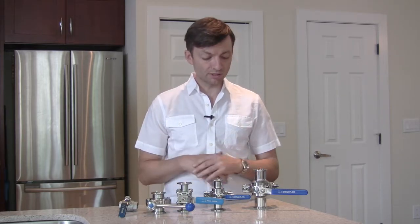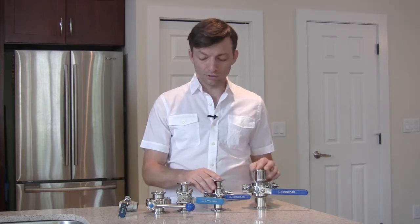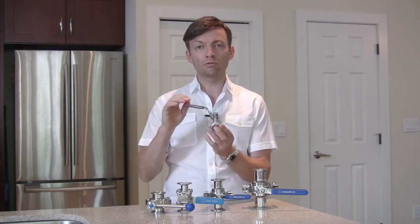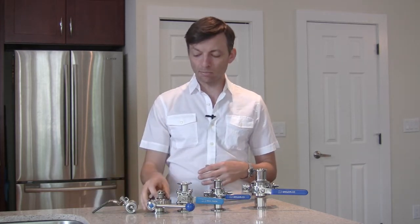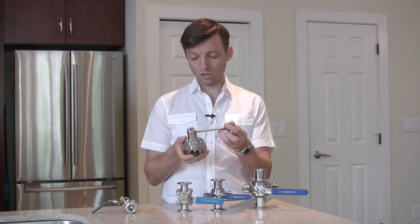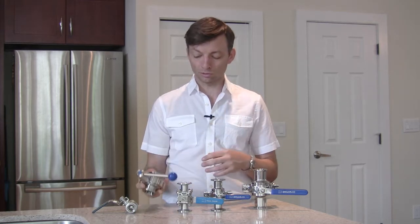The type of closure — there are two main kinds. The first is a ball valve type closure with a little ball that turns; a quarter turn of the valve will go from completely closed to completely open. And butterfly valves, which use a thin disc inside the valve, also operate on the principle that a quarter turn goes from fully closed to fully open.